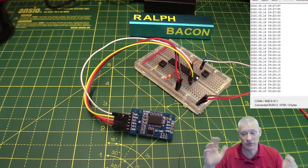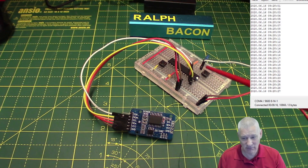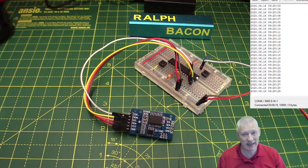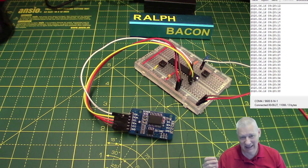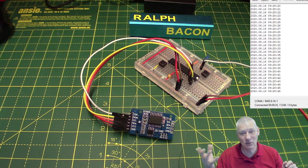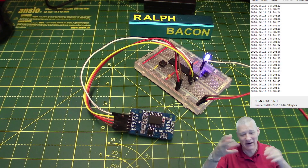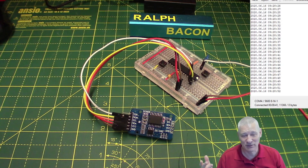What's happening is the Arduino goes to sleep and current consumption is low but not super low - we'll come on to that. The actual Arduino takes about best case 0.2 microamps, but that's a workbench value. In the real world when you've got a whole project with various things attached, unless you do something else you're never going to get 0.2 microamps.